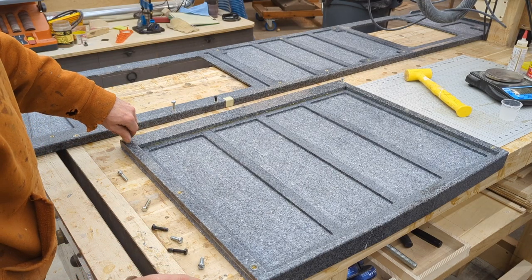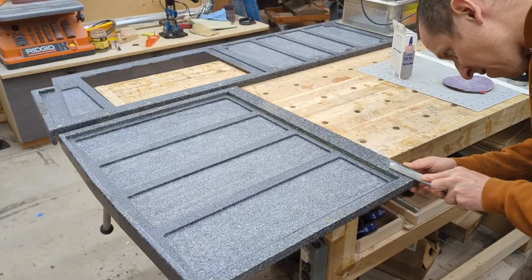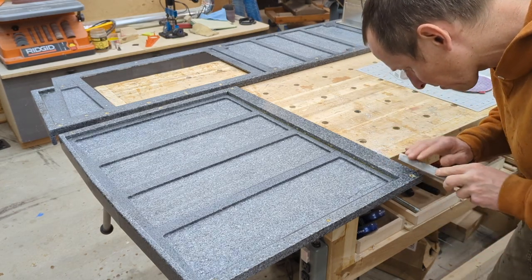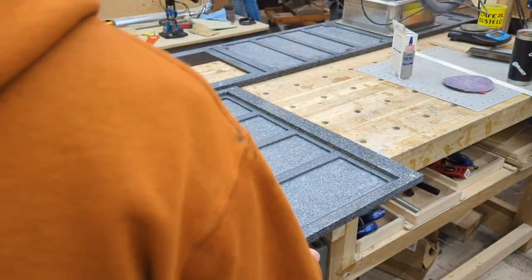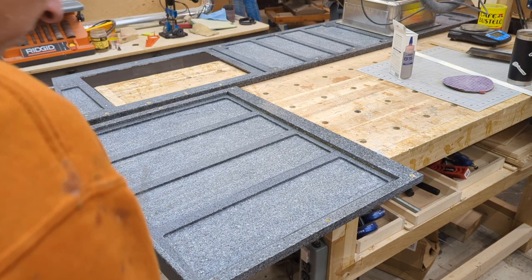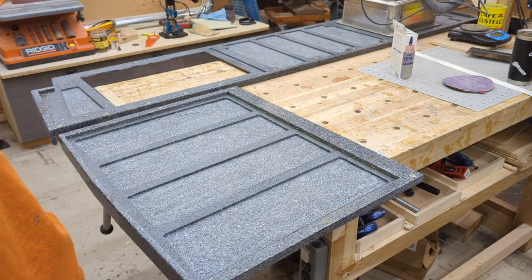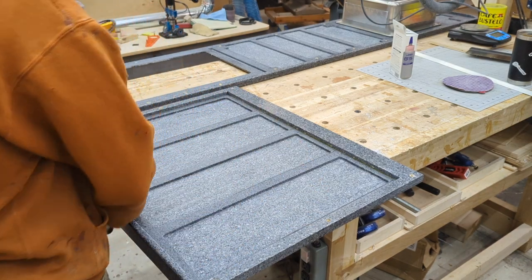After a couple hours, I use either a chisel or a flat file to work that epoxy nice and flat. And then you've got a bunch of threaded inserts that you can use to install your countertop. Now, I've seen people install entire countertops with just four little L brackets, especially going into particle board. I just don't think that would hold up in a stressful situation. So on this countertop, I've got 12 threaded inserts installed on the bottom of it that are helping to hold it down to my kitchen.